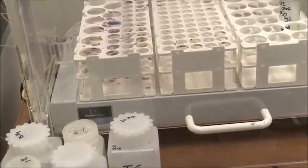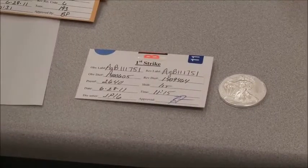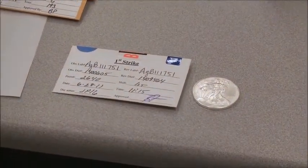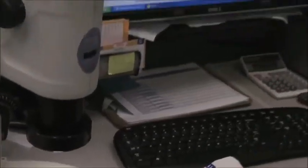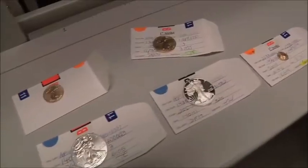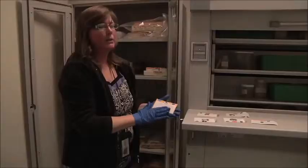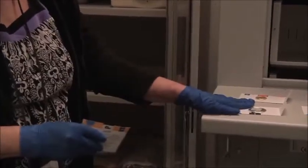Our second function is that we have three quality inspectors down on the production floor, one on each shift. They're responsible for looking at the first strikes, doing roving inspections, and looking at the last strike coins. They photograph them and archive the coins and record all the data in a database. Once we get the first strike, we also get the last piece — the last coin before the dies are retired. So we do have a record of minting from the first strike all the way to the last piece of the coin.